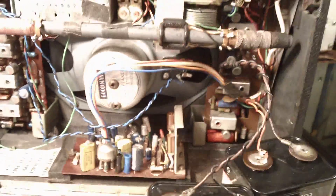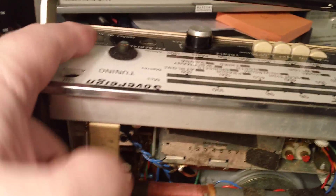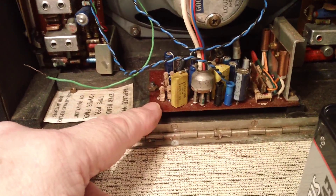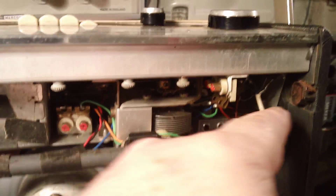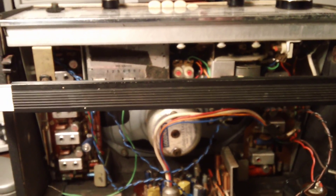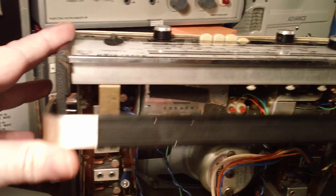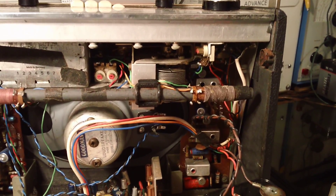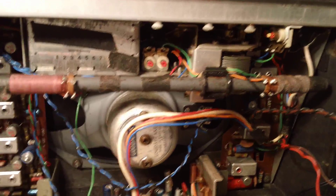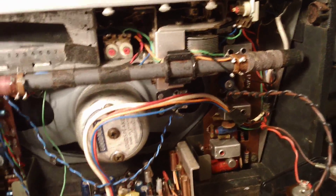So the work ahead - I'll stop waffling - will involve cleaning and replacing the knobs on the front. The felt underneath will be replaced. The amplifier board might be replaced with a recapped version. All electrolytics will need changing. Then there are all the fittings here that have gone rusty, so I'll be replacing all of those. The handle is not an original one - the original should be a plain black covered, rather more springy material. I'll be on the lookout for another RP18 to try and get the correct original handle, and then we'll have a fully restored set.